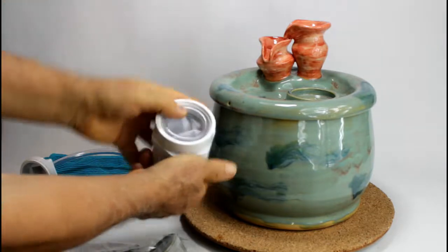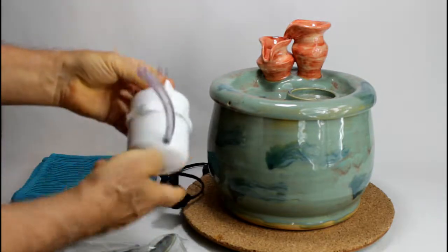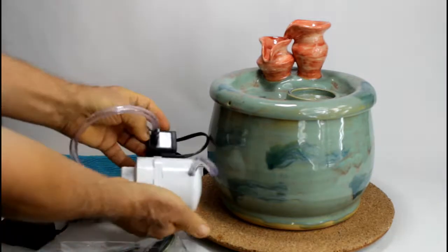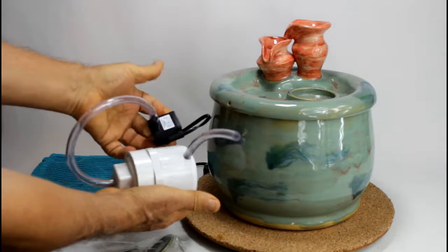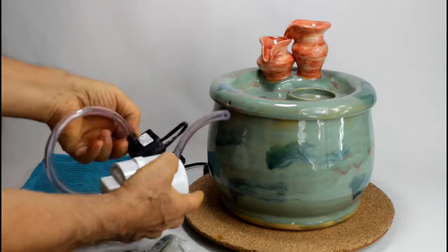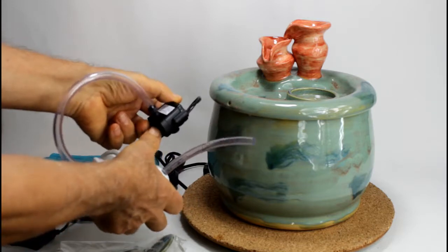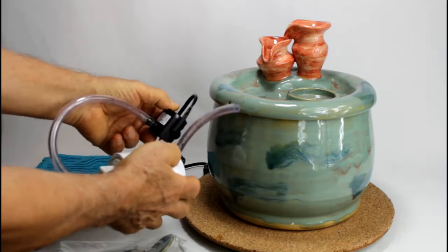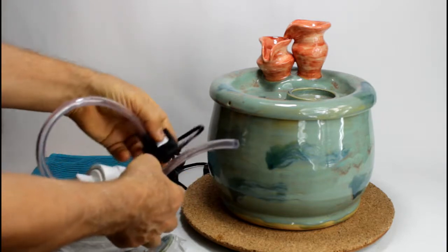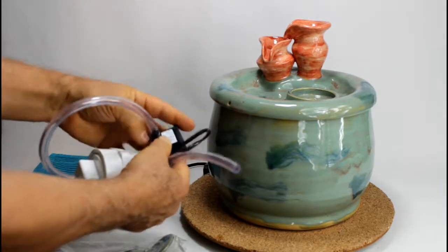Put the ring in and close the cap. Make sure it looks approximately like this, so that the pump is to the left and the inlet of the pump is here. Just in case it breaks from the floor and swims up, the inlet needs to be underneath and always in the water. If you turn the pump the other direction and the inlet is here, then the inlet will swim up, be out of the water, suck air, and this will hurt the pump.